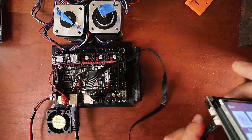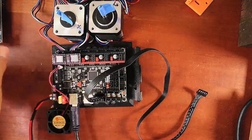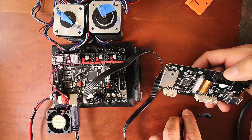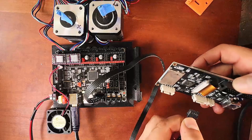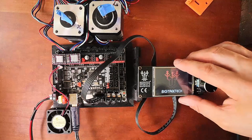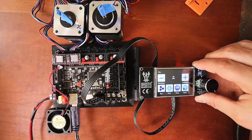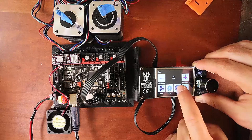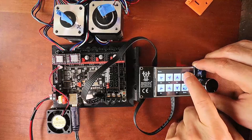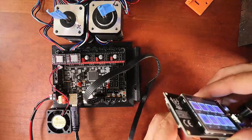Now I'm going to disconnect the TFT and connect another one — this is the TFT-28. I'm going to find the RS-232 port, or the port we're going to be using, which is not labeled RS-232 this time. Reconnect it, go to Fan, go to full power — the fan is operating. I'll stop it, go back, go to Movement, do 10 millimeters, and move the X stepper. That operates, so I'm going to disconnect this as well.